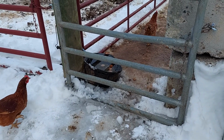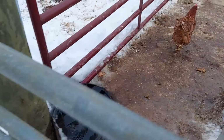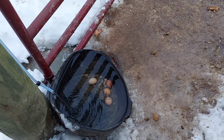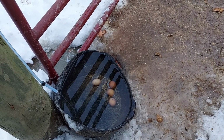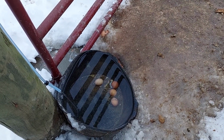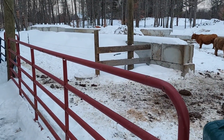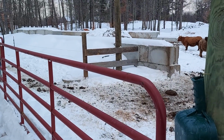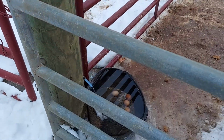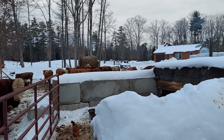You know, that little temporary dish that I had to use, I had it so I used it, hasn't crusted over yet with that water flowing in there. I probably can gate this down a little bit more. I may go get a needle valve and gate it down just a hair more in that riser over there, slow it down just a hair, but I wanted to play with this and see what we've got. Before I do that, I may check this temperature and just see what we're running, and make sure we're maintaining that temperature.